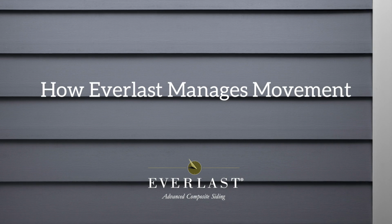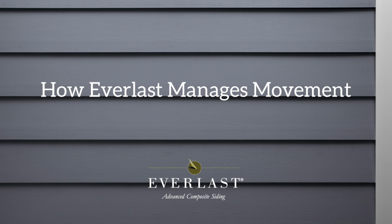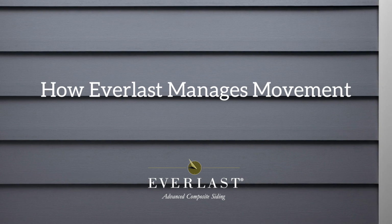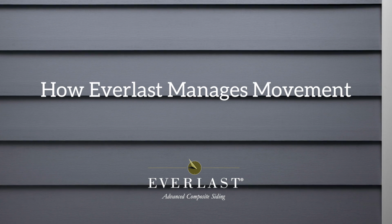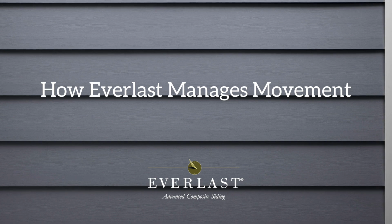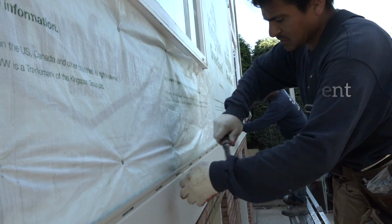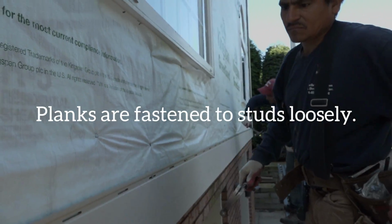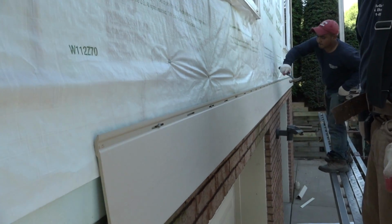As with the majority of exterior siding products, Everlast planks expand and contract horizontally. Everlast's unique composite formula greatly minimizes this movement. However, movement remains inevitable. Therefore, Everlast siding has been engineered to manage expansion and contraction during the installation process in 3 ways. First, planks must be fastened to studs in a loose or floating fashion. This allows the plank to move freely left and right.